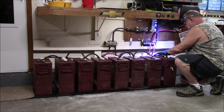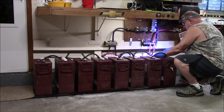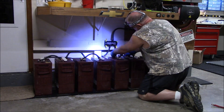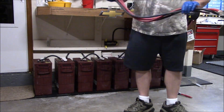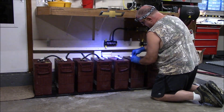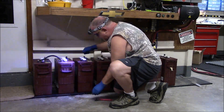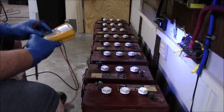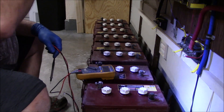In this portion I'm going to show you me disconnecting everything — I sped it up because I hate long videos and I'm sure you don't either. Essentially I disconnected the two strings from the positive and negative bus bars and then started de-stringing the batteries. Gloves and eye protection throughout.